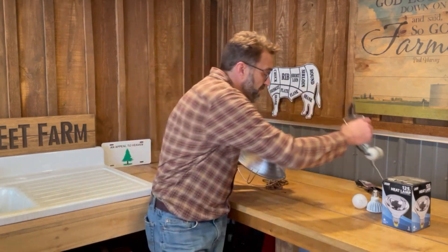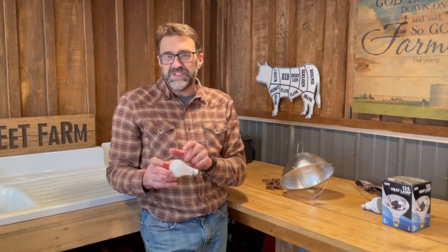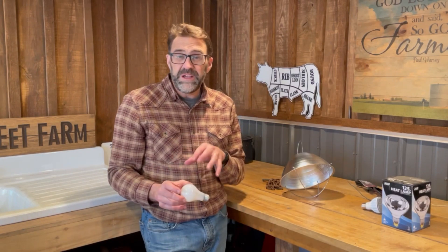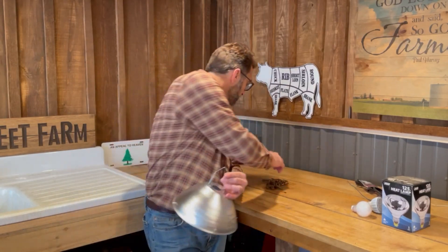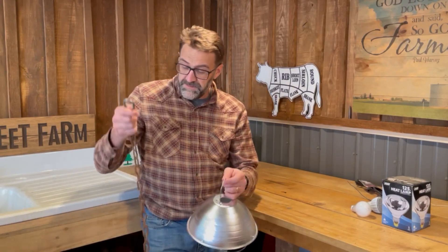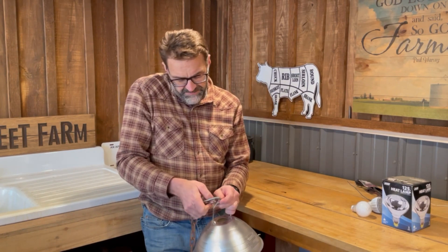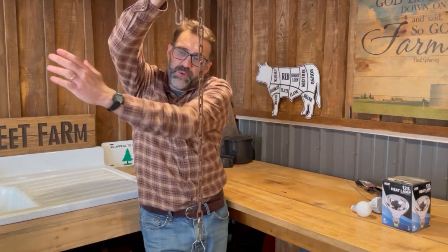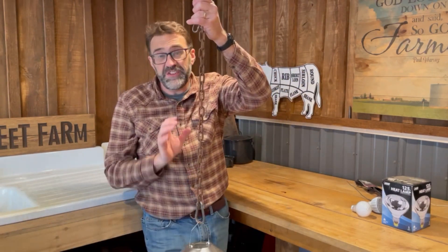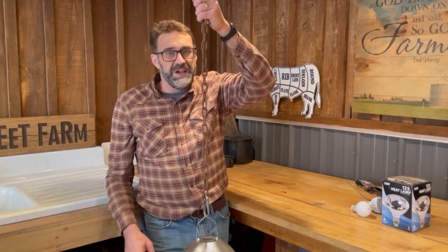Sometimes you can use a regular light bulb for a little bit of heat when temperatures are warming up. LEDs aren't going to give off any heat. When I just need a little heat I'll use a regular light bulb, but I still secure it. What I've started doing is taking an old chain, using a quick snap, snapping it onto the lamp, then taking that chain up and fastening it to a beam. If you need to, run a two-by-four across your pen to fasten it up — take the time to use a chain or something solid.